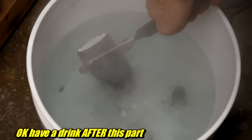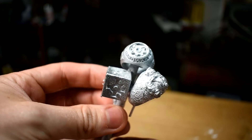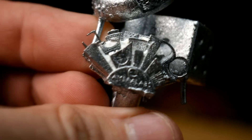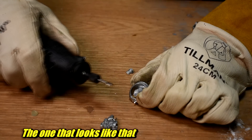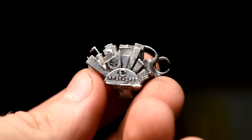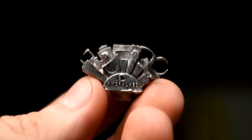Wait till the metal is solidified, then dump it in water - the heat kind of breaks through the plaster. Here it is. It looks kind of cruddy at first. I definitely poured too hot, but that's not a bad thing because hotter metal is more fluid, especially this stuff. I wanted to see if that fluid metal could get in all the little nooks and crannies of the Amerilabs test town. Definitely wear a respirator, ear protection, eye protection, and everything protection for this next part. Get a Dremel and cut the things off - a fluted cutter seemed to work best. You can see the metal didn't flow into everything, but this is without vacuum help. You can even see the windows on the buildings and read 'Amerilabs' on it.